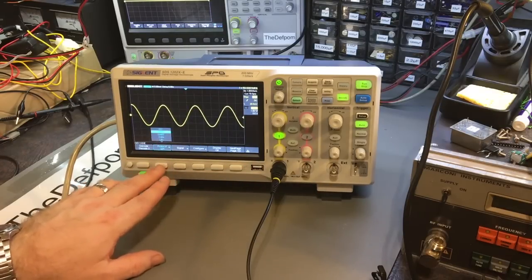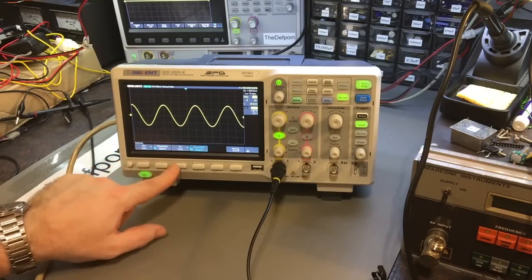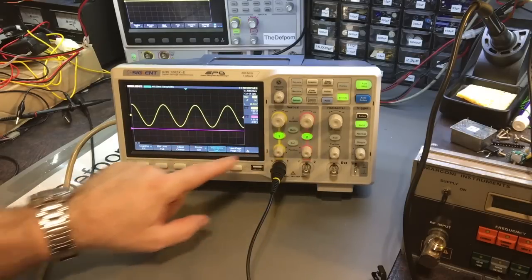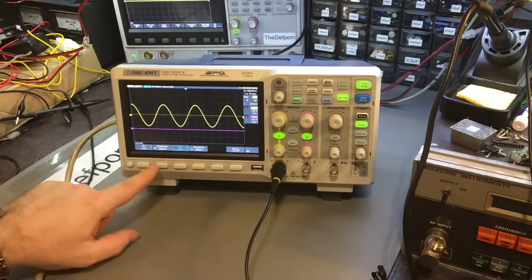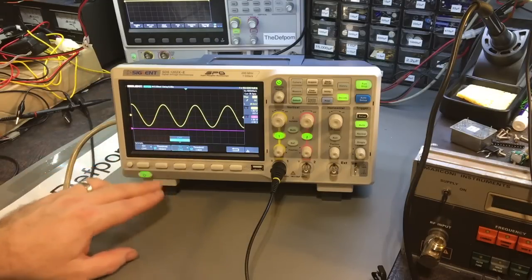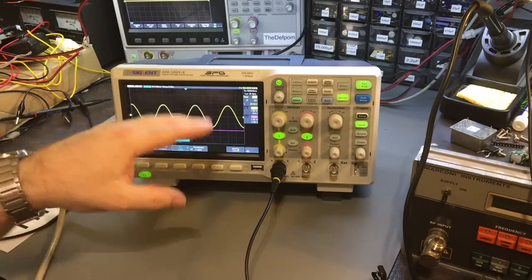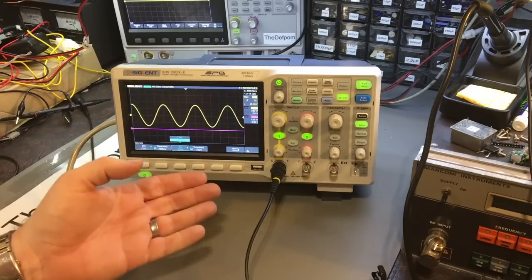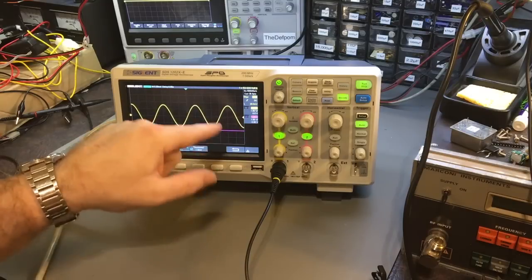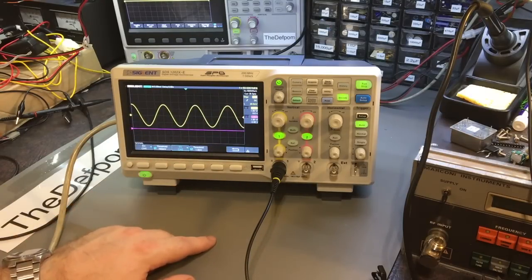Okay, UART again. You've got the signal options there, channel 1 or channel 2, whichever one. Obviously, it's turned off right now, I'll turn it on so I can show you. So then you can select channel 1 and channel 2, so you can have RX on one channel, TX on the other. Again, you set the thresholds for the triggering. So you can set the range. If you've only got a 3.3 volt bus or a 5 volt bus, for example, then you can set it to a nice medium point, so you make sure you get accurate readings from that.